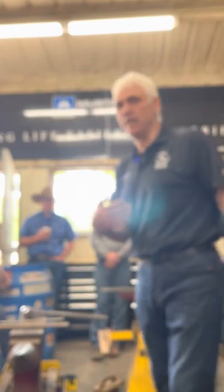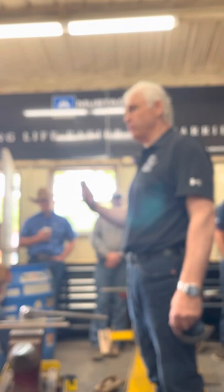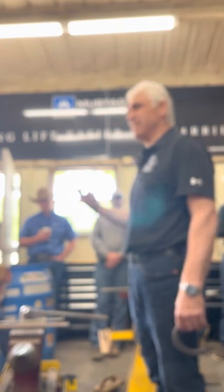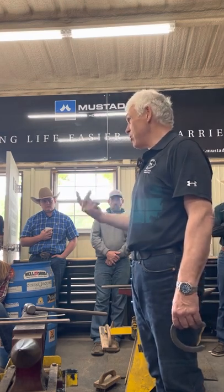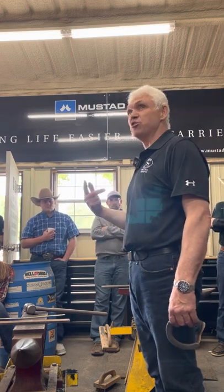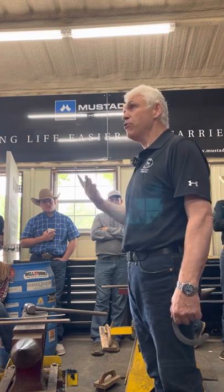Tong position is what gives you accuracy. A lot of people forget the tongs need maintenance. They might sharpen their knife every day, but they stop dealing with their forging tools, and they end up with garbage forging tools. They were very nice forging tools when they bought them, but they never fixed them. Tongs need periodically resetting, because they become worn. You can't hit shoes and beat on shoes and hope the tongs don't get damaged. Periodically, tongs need the rivets changing. Okay, or you can buy a new pair, I don't care. But you need good fitting tongs.